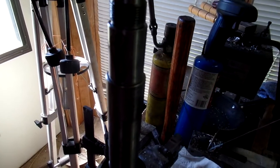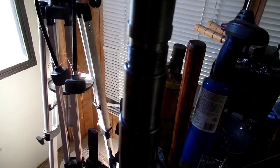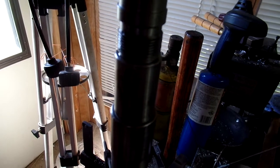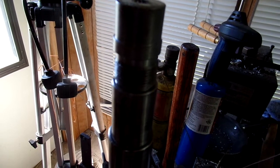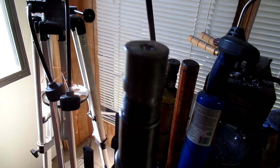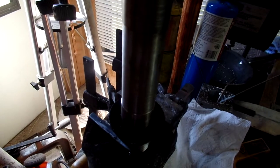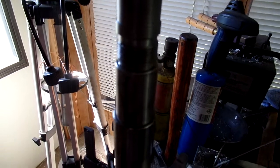Some lathes — not this one in particular — give a torque reading: so many pounds on the side of a chuck to see how easy it spins over. Some of them want it to spin half a revolution, something like that. My Grizzly says nothing about doing anything with the bearings, and that's a weakness in the Grizzly manual.